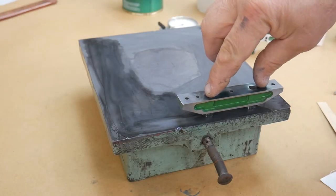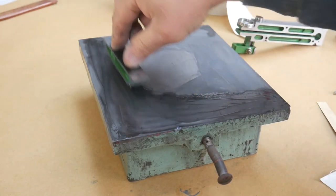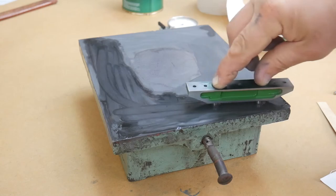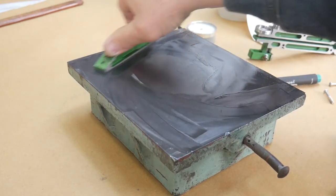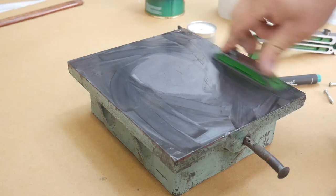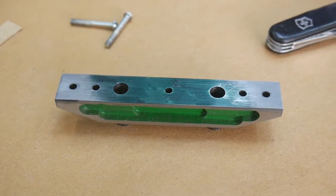Interference test on flat glass. I know that there is a depression in the center of the plate, 1 micron. So I use the side surface. Some planes also need to be additionally lapped. The right areas are done. That's enough.